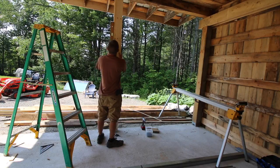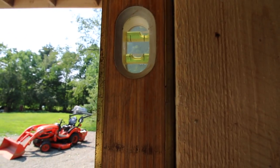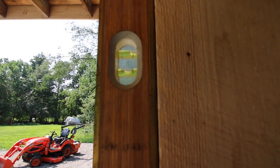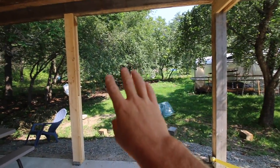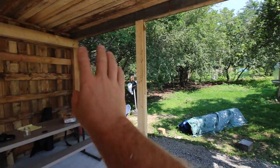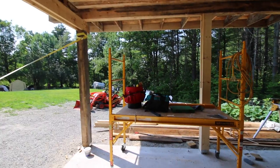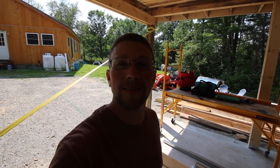I'm going to leave the top loose again — I just want to make sure it's close to level for now. The bubble is off to the right a smidge, but before we go to tighten that up with a screw, that's when we can really level it off. This is good and close for now, so tomorrow we can get it all adjusted and finished off. If you can visualize it: the top almost 4 feet down will be a big picture window, underneath that will be a knee wall, and all back there will be a wall. So you'll have window, wall on one side, and wall, wall, window on the other.